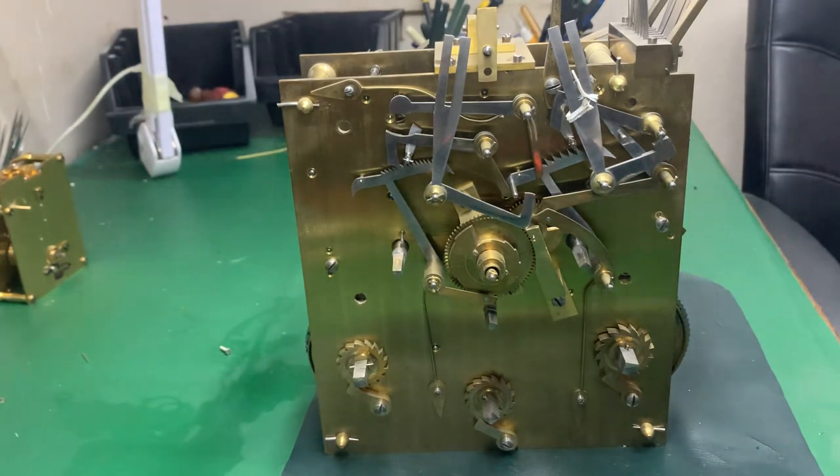It was out of beat and so what we tend to do is get the clock running and then check it out. As you can see I have a cable tie lifting in order to operate the chime train continuously. I wind it all the way up and let it run through continually until it runs all the way down, and I do that with every train to check out what's going on — is anything stopping it. Then we list all those problems and have a look at them as we go through the service.